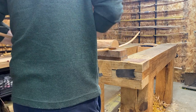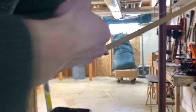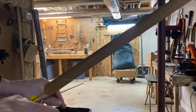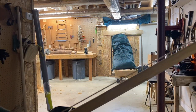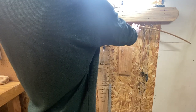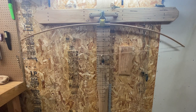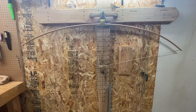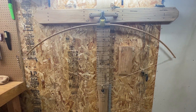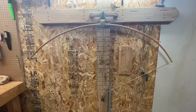Those were the top five most common reasons why bows break — now for the torture test. What did I learn about using cedar? Well, you can use it; it does make a bow, but it's really tough. I made a very long bow and only got about 20 pounds of draw weight out of it. I was not pulling it to full draw and I really didn't trust the bow. But when I pulled it to failure, it took a lot more than I expected to break it — I even had to add an extra yardstick to the tiller tree. This is a good example showing that marginal bow woods are usable, but you may have to lower the draw weight, make a longer or wider bow, and you may not trust the results. The fact that the bow took so long to break is also a win for wood selection — even without a perfect tiller, it took over 40 inches of draw to break the thing.